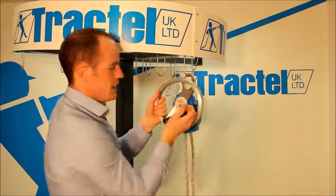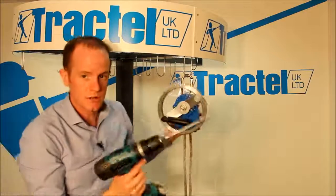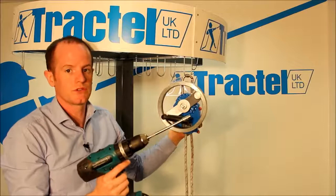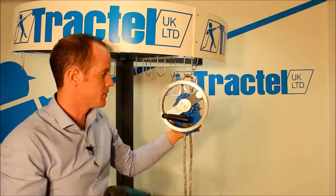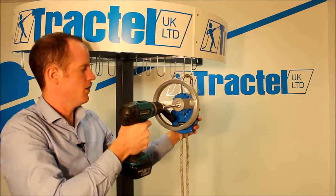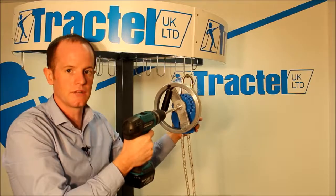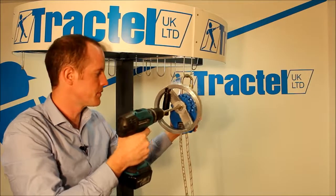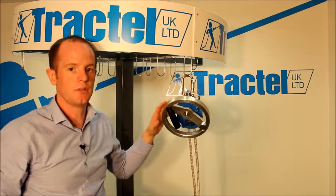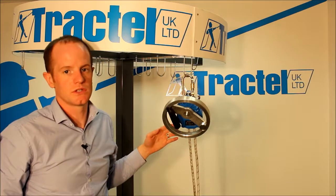If you want to make life a bit easier and a bit quicker, on the new model you can use a drill. The drill has to be 300 watt with a 14 volt battery minimum and then an 8mm socket. The socket just goes onto the rear of the device there. We power it up. You can quickly and easily raise a casualty back to the anchor point. So unlike the standard version, you've got the recovery on the back. It's very popular for industries like the wind industry and also for rescue from high structures such as cranes.